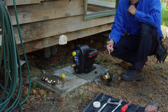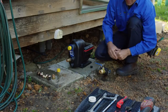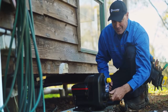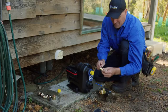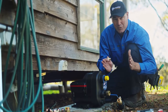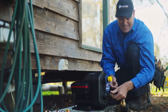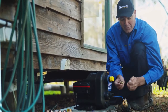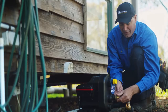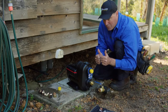The isolation valve is now installed. Here's the feed from the rainwater tank — turn it on and it feeds. All I need to do now is run the pipe around here and into the inlet loose nut connection. With these loose nut connections, it's very important to understand: the O-ring is what seals the two parts together, and the nut screws onto the thread to jam that O-ring nice and tight. A lot of guys put thread seal on this thread — all that's doing is making the nut harder to screw on. You want it as easy as possible so you can compress that O-ring. So never ever, if you're using loose nut connections, use thread seal. The nut has to go on as easy as possible, then tighten it up to jam that O-ring and it will be sealed and won't drip.